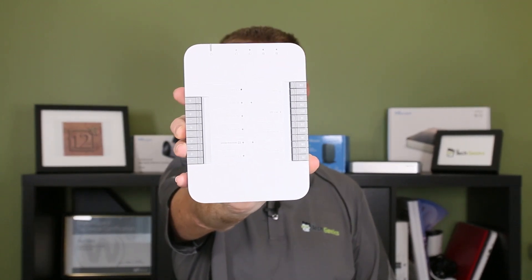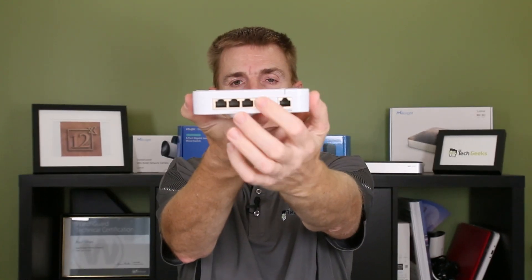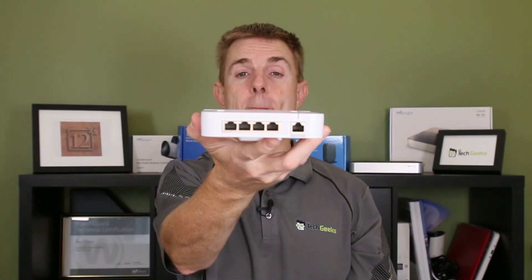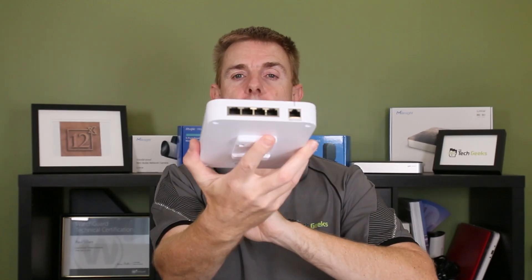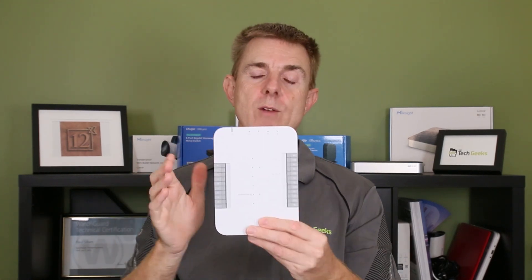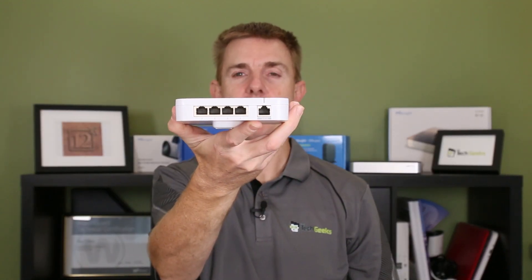This is the hub. It's about 12 volt wiring and is PoE powered — it needs 802.3BT, so PoE++. The PoE comes in from your Ubiquiti pro switch. You have options for readers to be plugged in, and you can add a camera for extra features, alerting, or monitoring. Think of that part as a little network switch, but it all relates to this hub. Then we have all the different wiring terminals on the sides — these go out to your doors, your strikes, and your door release options. One of these goes to a release bar or button on the inside so someone approaching the door for exit can push it and release it.